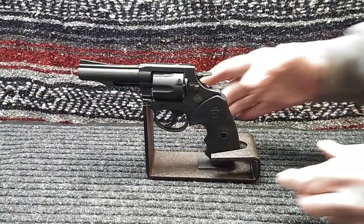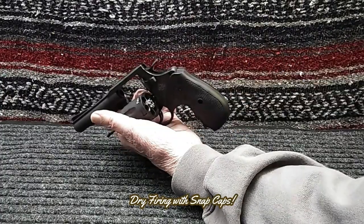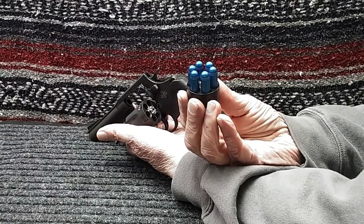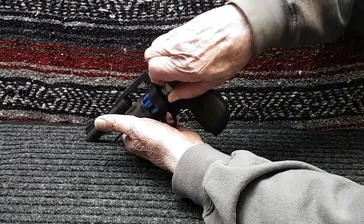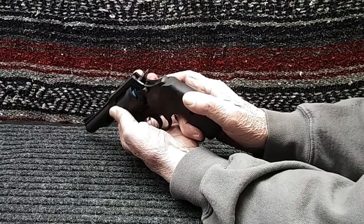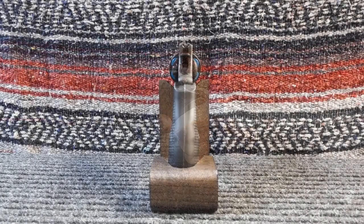While I could not tell from dry firing if light primer strikes were going to be an issue, I did observe that the hammer seemed consistent when it fell. That's the best that I could hope for. Now, as with pistols, revolvers can be picky about what ammunition is being fed through them. Hammer inertia and primer hardness can seriously affect whether a firearm is going to fire or not. I had to run the M200 with the stock hammer spring and factory ammunition primers and take my chances.